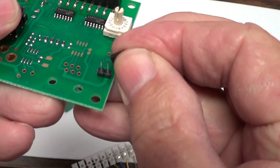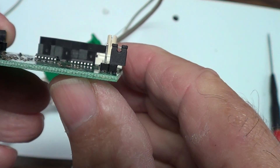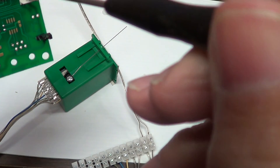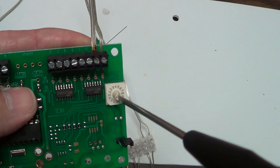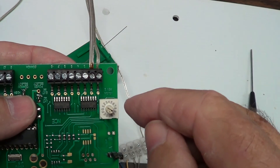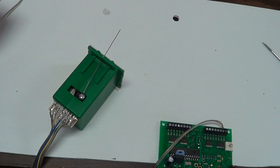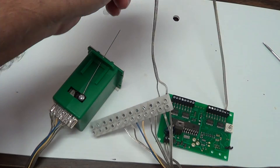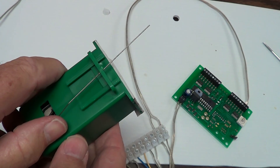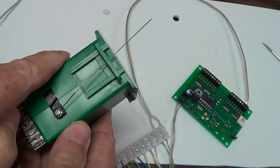Next step: go over and take the shunt pin off. I stick it back on one terminal so it doesn't get lost — no connection now, so the programming is done. Then take a screwdriver and turn the rotary off of zero, back to some other position, just not one through seven's neighbors — get it away from zero. You can tell if you have power because if you try to push on this machine you cannot move it with your thumb — it goes back to the stall position.